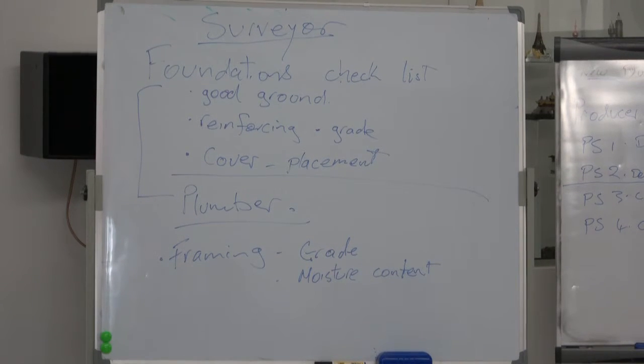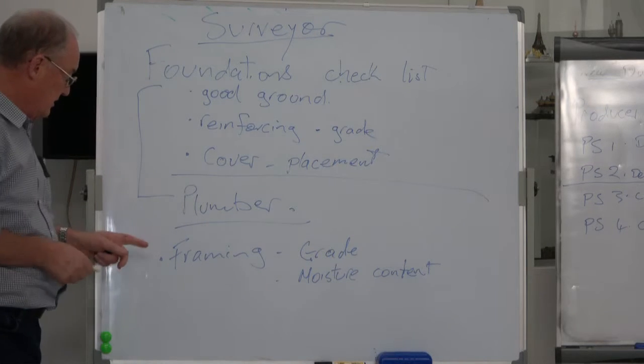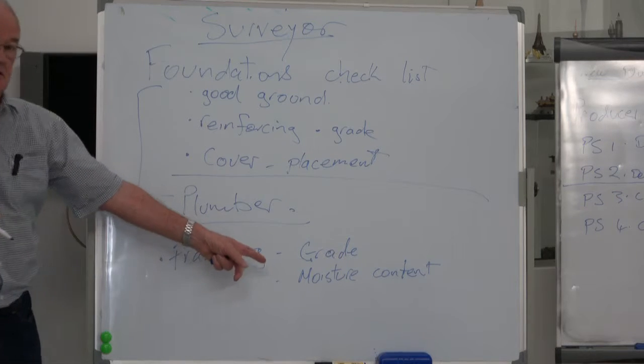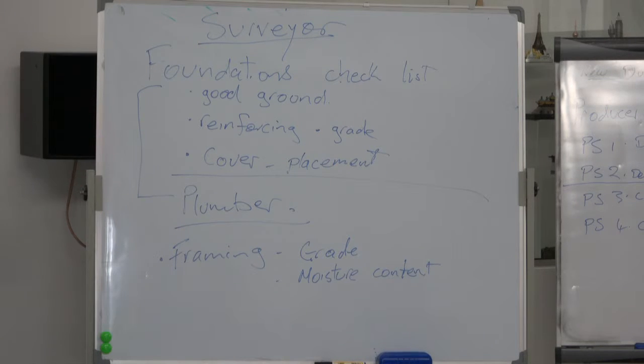it's got in that book, and you can't go wrong, because this is the book that's been accepted by the Ministry of Building and Housing. Make sure you get the lintels. If you've got a framing for the lintels for the windows, and in high wind zone, in that book it tells you you've got to strap them down, the lintels strapped down, right down through to the floor.